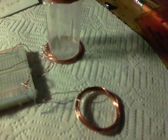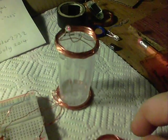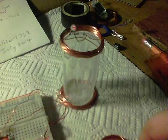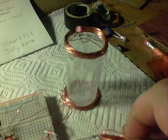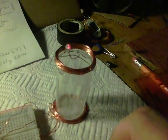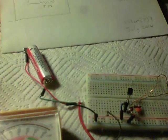The positioning of this coil actually does matter quite a lot. If I move it around you'll see that light change — in fact it does brighten in some places and dims down, and there it's gone off, and comes back again. Also the direction and the tilt — you can see quite a lot more brightness in certain positions, and yet we're still around 3 milliamps. So that's the kind of direction I want to take this: to get as little current needed for as good wireless effects, all from just one AA battery.